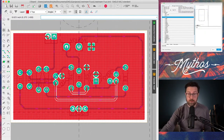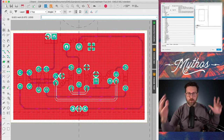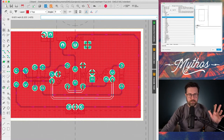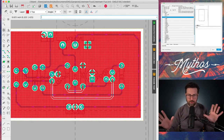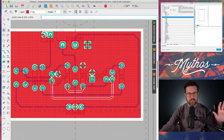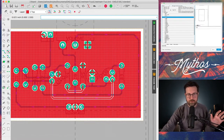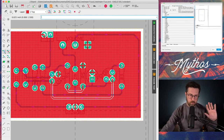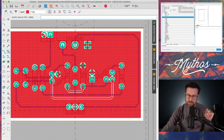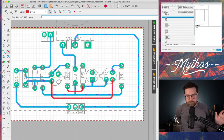You can do this on both the top and the bottom layer, but so all the grounds are connected. You don't have to draw those traces. And because there's so much room in between the resistors and the caps, there's enough space for the ground pour to flow through this. And this is a simple circuit. On more complicated circuits, sometimes you have to draw vias and things, but for this, not necessary. But on the left, there's a rip up tool right by the route air wire tool. You can go to rip up and you can't see it because when you run the rat's nest, it goes away. But if you kind of know where you outlined that polygon for your ground pour, you can click it once, it'll highlight it, click it again, and the ground pour goes away. But it's really helpful and really handy.